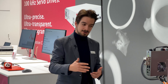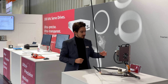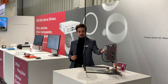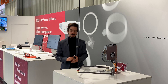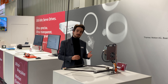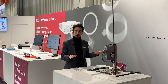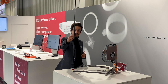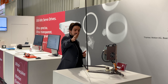The pendulum will speed up in circles while balancing the rod. The code for this is all inside here — it's written in C# because there's a virtual machine capable of running .NET languages in real time. That means at a frequency of 10 kHz this code will be executed to make this pendulum motion. No additional computer is necessary, only for programming. As you can see, there is also disturbance rejection and the pendulum is able to handle any disturbances.